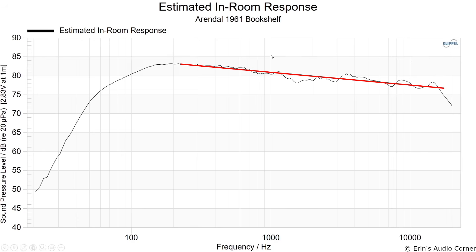Generally speaking, you can expect a little bit of presence region knocked out by about two to three dB in the one and a half to two kilohertz region. There's really nothing about the speaker that stood out to me in a negative way. I was frankly impressed with the linearity, the output, and the overall ability to just sound good from multiple seats in my home theater without it being a huge speaker.